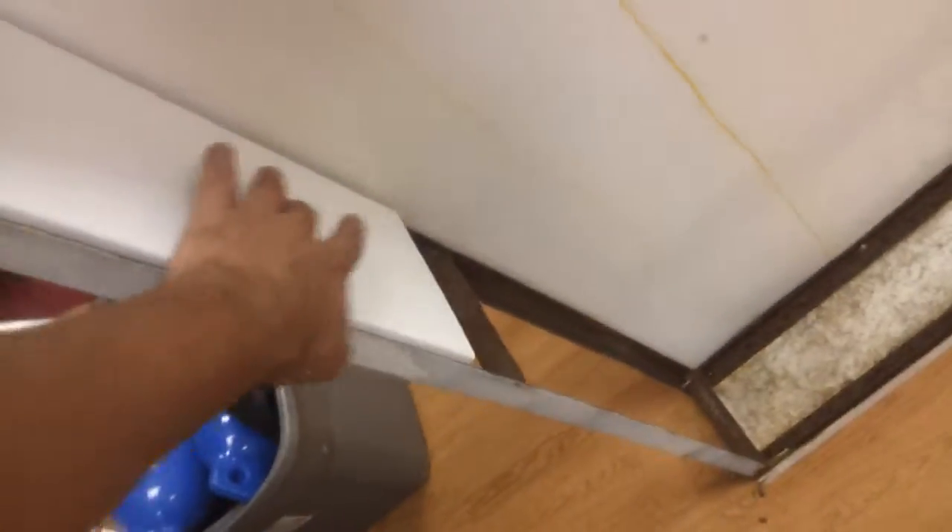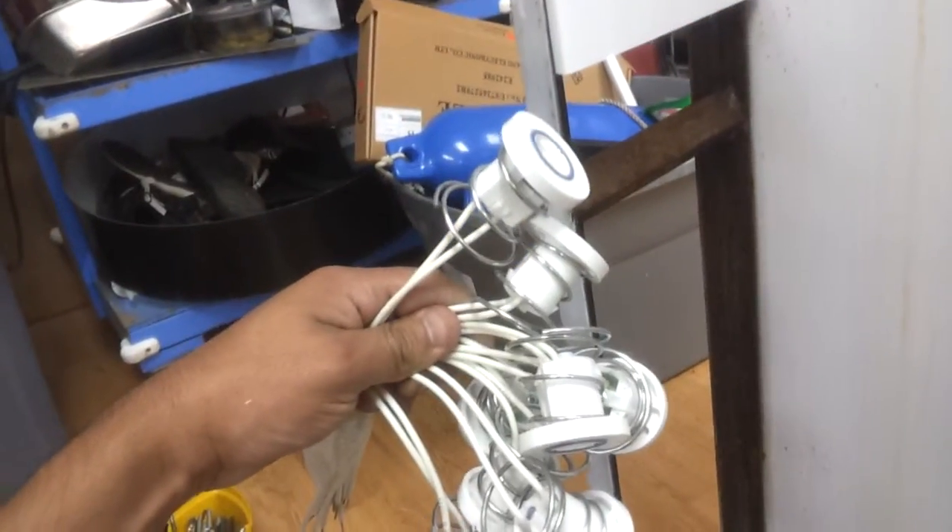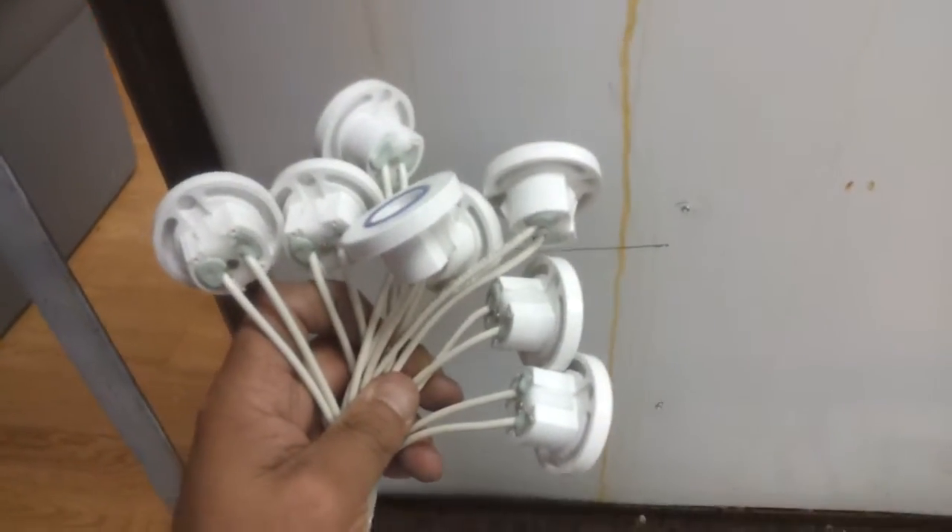What I'm doing is I've taken some aluminum and I've bent it with a brake, and then I'm fitting it in here. Once it's fitted in there, I'm going to drill a couple holes into the aluminum. And then I can take the connectors — they're sitting in this box here — I'll drill a couple holes, and then these spring-loaded connectors will sit in there, so when the bulb goes in it'll push in. The other side will have a connector too — these flat ones without the springs — and it'll apply some pressure so it'll hold the bulbs in there.